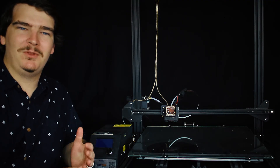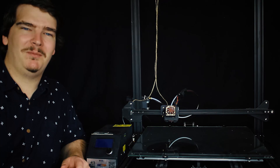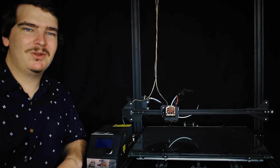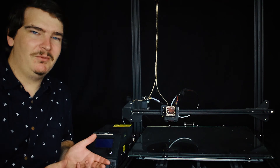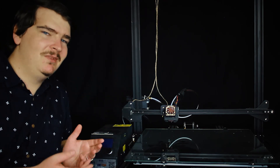Here we have one of my biggest printers. With a mammoth 500 millimeters in each direction build volume, this is too big for most people's houses and out of most people's 3D printing budget. It's also lacking on some features one may get used to on printers made by Artillery. This is the CR10 S5. I don't use this printer very often and I don't think I've used it this year because 99% of what I print fits on one of the small printers. The pros are it's got a massive build volume and a glass bed. The cons are it's got a Bowden extruder, it's big to fit in your house, it's very expensive, and it's not really accurate for small stuff. The reason I don't use it for smaller things is that it can't keep up with the print speeds of other printers — it's constantly lugging around this heavy bed back and forth, and even with the giant stepper motor at the back it just can't keep up.